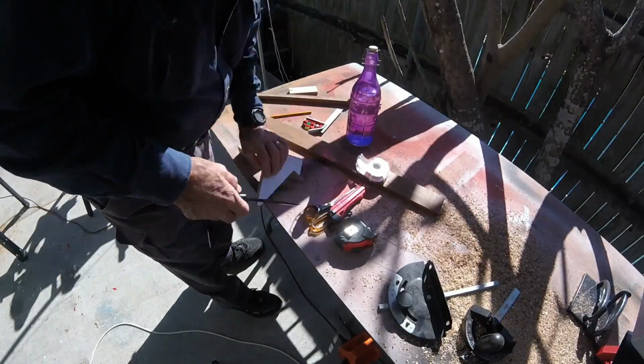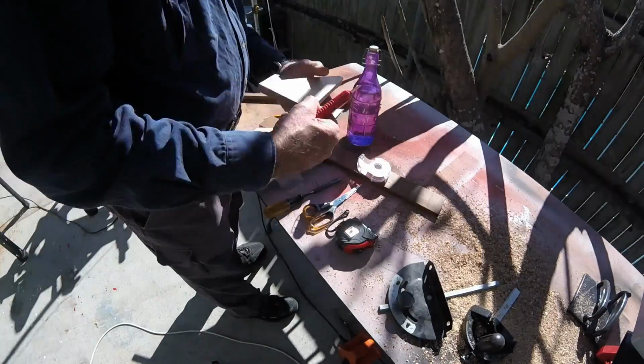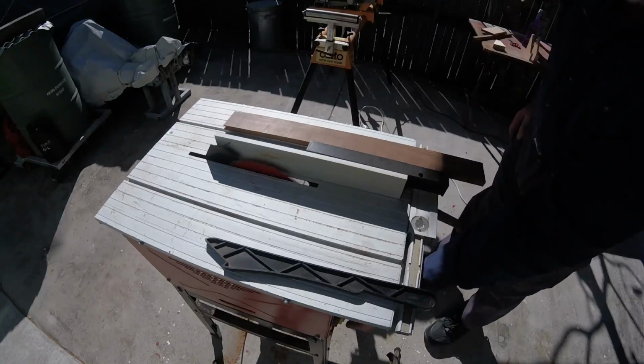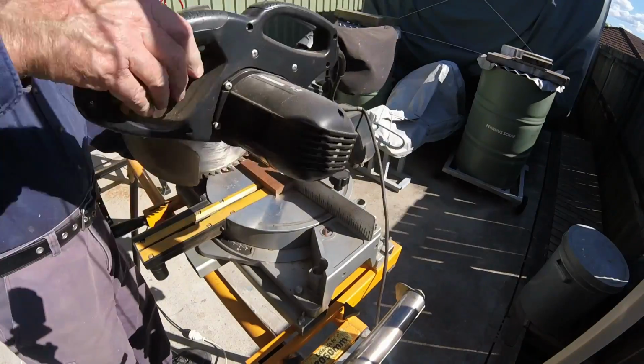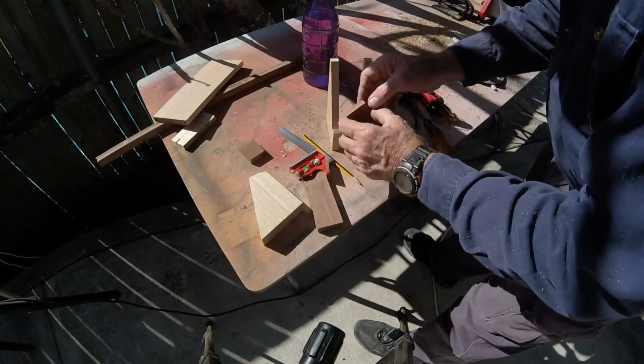Here I clean up the phone recess with the chisel and then separate the two sides. I trim the blue gum piece to 45mm wide and then cut two pieces 120mm and 40mm long that I will use to space out the two sides.